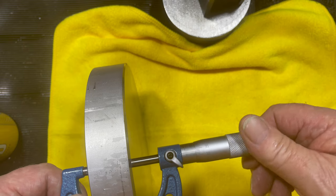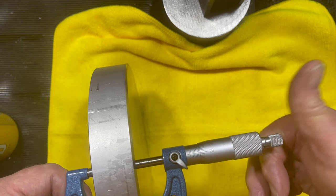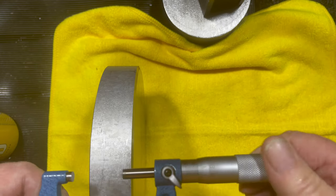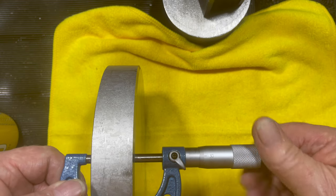If, for example, I wanted to machine a chuck backplate, I would normally remove the chuck after machining the spindle mount, then transfer the chuck with the parts still attached to the mill table, then bore and thread the holes for the camlock studs and keeper screws.